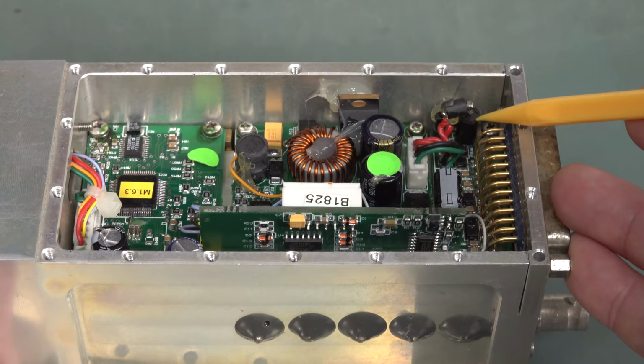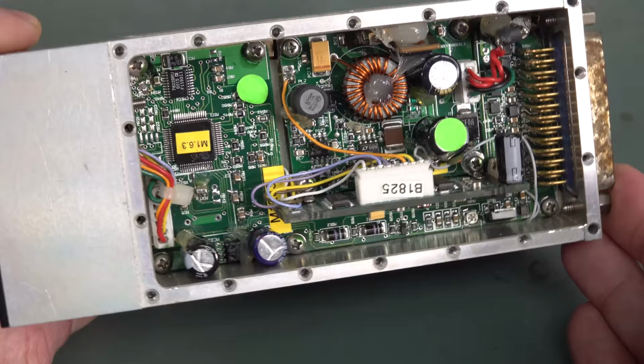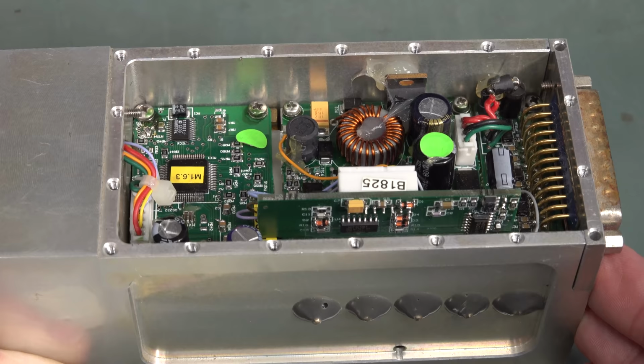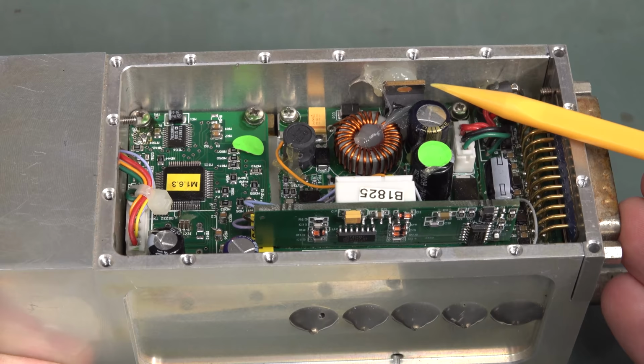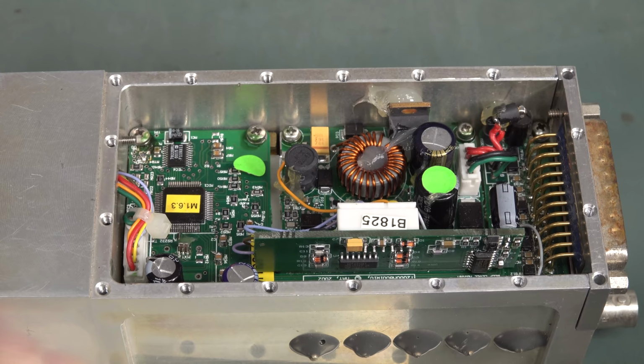And yeah, they bodged that in. More hot snot down here, once again, to stop the capacitors vibrating, flapping around in the breeze, because obviously you get a lot of vibration on an aircraft. So if you just had a freestanding TO220 package like that, it would vibrate loose in next to no time. Trust me, I have experience in this, where stuff in a production environment that was wheeled around